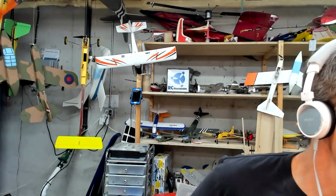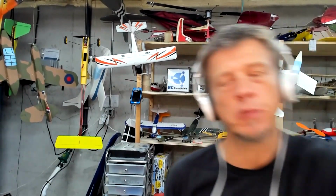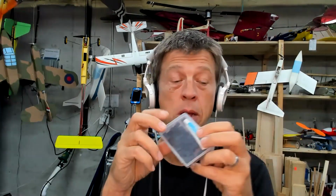So what I did to correct that, I have some, where are they? Some heat sinks. There we go, some heat sinks for another project. And these heat sinks came with a heat conductive glue. And I'm like, maybe that'll kill 2 birds with 1 stone. It'll help the heat sink of the clamshell mount work a little better and maybe hold that motor in place. So I spread some of this around on the clamshell before I put the motor in, and knocking on wood, that's been holding it so far. So I think I'm good to go with the motor.